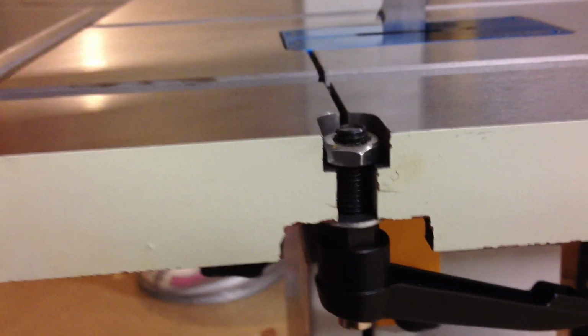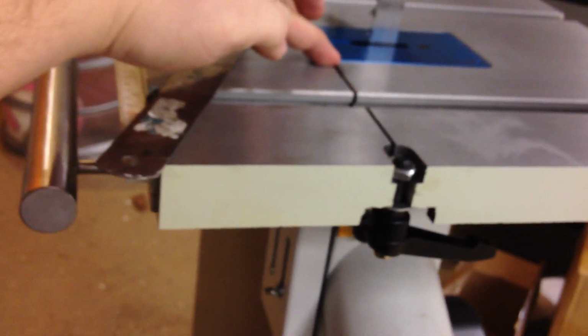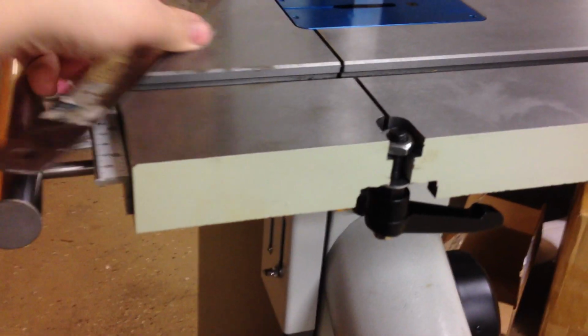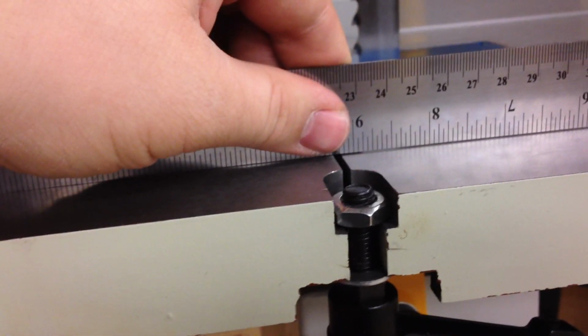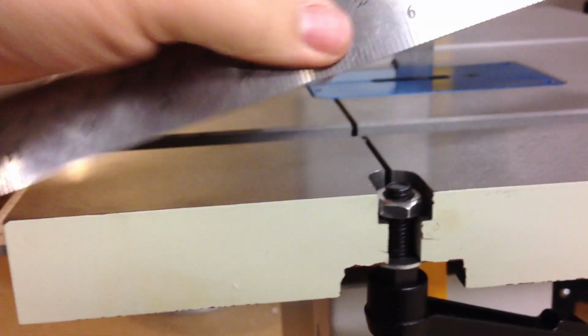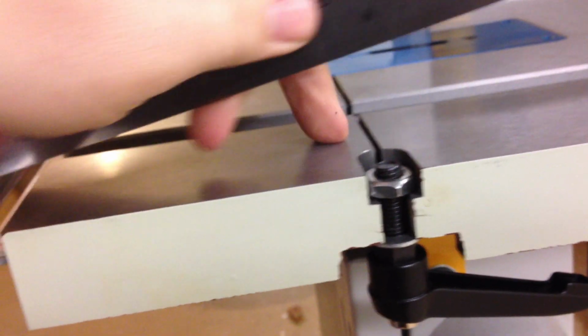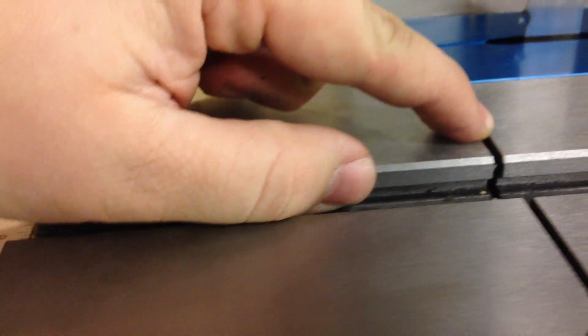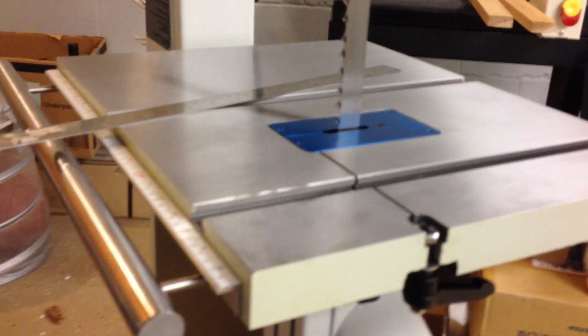And the other thing is that this half of the machine seemed to be, after this cut, torqued up like this, so that the worst part of the ridge was over here. So what I did is, I moved it down a little bit, and now there's a drop on this side of the table, on the farthest end out from the edge, which is actually a whole lot better than having a rise on any part of this, because now the material will flow over it and it won't get caught. The other thing that I did to try and help the situation a bit was take a file and put a chamfer edge on this, so that if it does hit, it has an angle and pushes itself back up. But yeah, I'm pretty sure that this is a fairly common issue with almost any bandsaw table that you get.